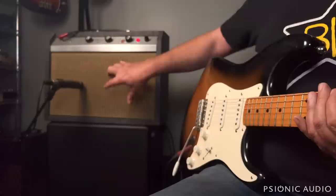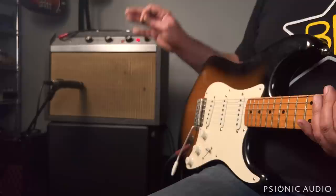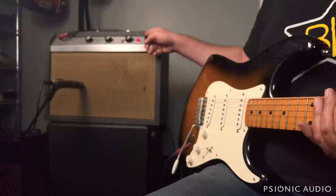With a 500K pot, 4.7 nanofarad should have pretty good low end. 10 nanofarad with the 500K would give very full low end. The T-filter is a variable. Again, the owner does not want any of this changed — these are not things I'm going to do. I'm thinking both in terms of how to make this amp sound better by changing the speaker, and also as a designer, what things could nudge it in some different directions.